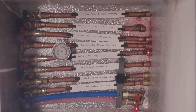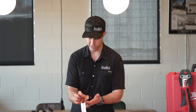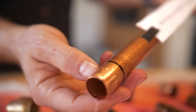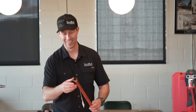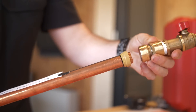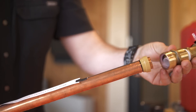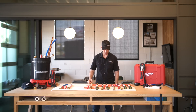SharkBites — we saw these before. They failed miserably on this test, as always. The interesting thing about this one is that you could see the marks from the claws of the SharkBite as if the teeth were scratching the chalkboard as they popped off the end. But on this fitting it didn't happen — they dug in and the plastic actually broke, which is interesting because this fitting is really mainly relying on plastic, not metal, to keep its strength.